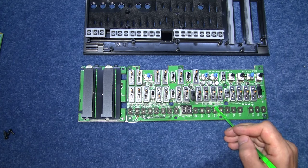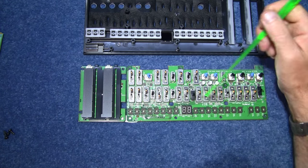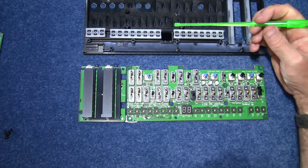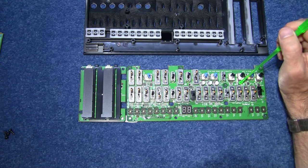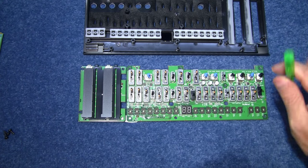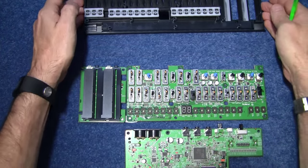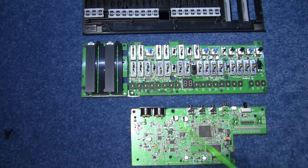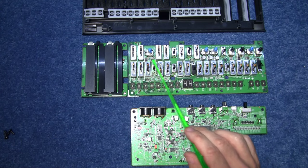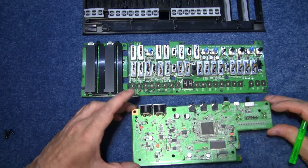These here are your push buttons — just those little carbon tracks. All the LEDs underneath them are surface mount. There's not much electronics on this side of the board, just a few capacitors and a few analogue-to-digital converters for the potentiometers. And here are your two touch ribbon controllers. I'm sure the only piece that's different in all three units is this switch gear board — the other two boards I'm sure are the same. So that's a look inside the new Boutiques from Roland.